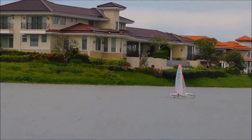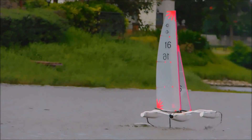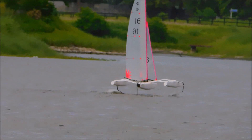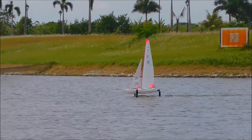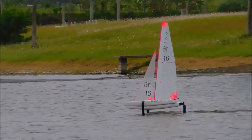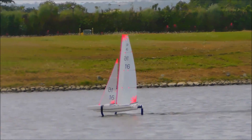These foils are the slimmest that we've made to date and are working well in light winds, but the downside is that the boat is skidding to leeward more when sailing upwind. This is a good thing for foiling as it can make the windward foil bite and hold down the boat, and it also depowers the rig when hard pressed, but could be a challenge when beating to windward in a fleet of boats.